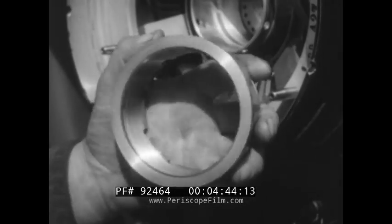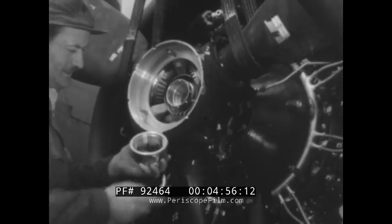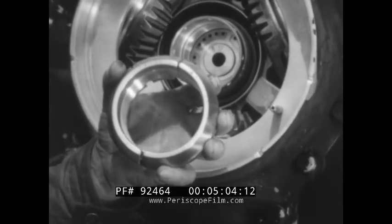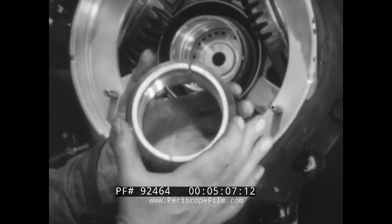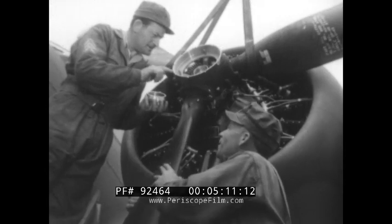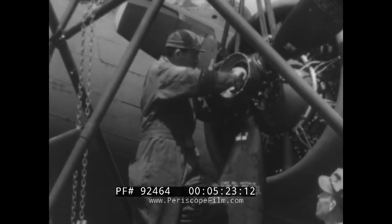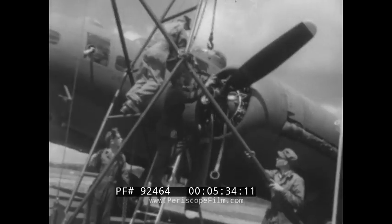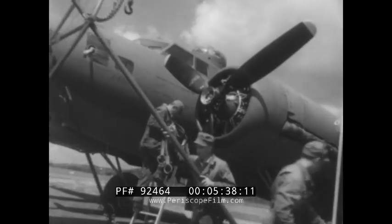The retaining nut is the mainstay of the whole prop assembly. I coat it with thread lubricant because it has to go in without any damage to its threads. The front cone, consisting of two sections, is attached to the retaining nut. I check to make sure the serial numbers on the two halves are identical — the cone was originally made in one piece, and the two parts must mate perfectly. I put this retaining nut on finger tight for the time being — that's enough to keep the prop on. Ott can take off the slings; the hoist is no longer needed. The boys move out the hoist and Ott replaces the ladders with a work stand.